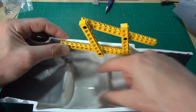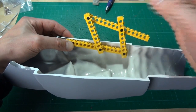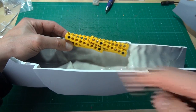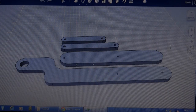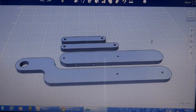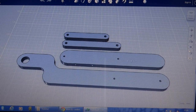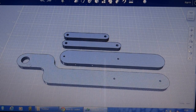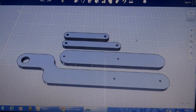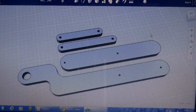Then I'll be going on to put some blocks of foam in that actually hold your arm, possibly a 3D printed brace that goes over the top, possibly on this piece over to the other side that clamps your arm. Here are my CAD parts — I did these in Autodesk 123D Design, which is free software you can download for free. Basically some simple parts: the two parallel hinges and two levers, and this part is the hinge for the elbow hinge to the bicep. I've measured these quite carefully from the Lego pieces and the actual pieces of armour, so now we need to 3D print them.